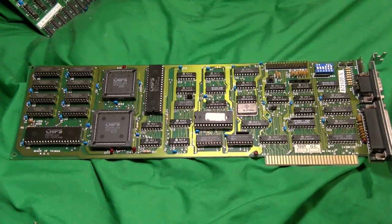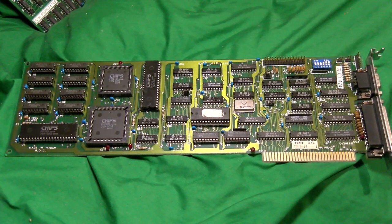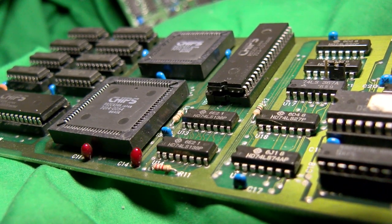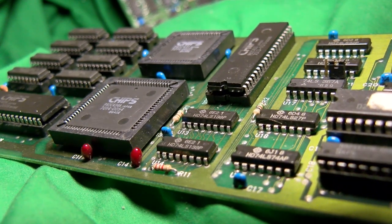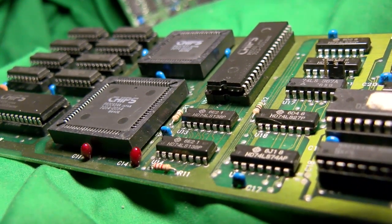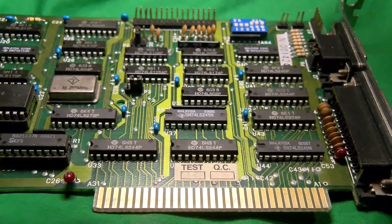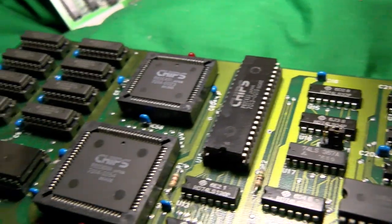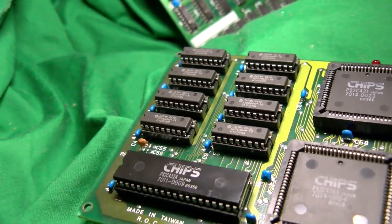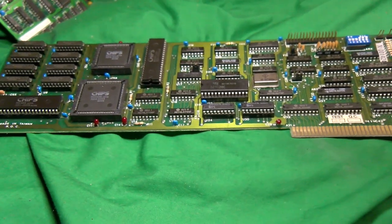The performance is quite poor and later cards might not work very well, as with my 286. I've come to suspect there's some kind of size limit for BIOS ROMs on them before the system just doesn't read anymore. It only reads so much, observes the checksum's invalid before it's read the rest of the ROM because it doesn't know to do that, and then won't try to execute what code it's read as a result. Obviously, it's not going to be a valid checksum there, so it's not going to bother. It's like, oh, this is bad, ignore it. Of course, it's also possible that some video BIOSes use instructions that don't exist in older 16-bit CPUs.